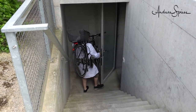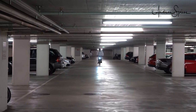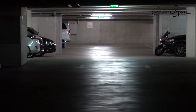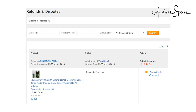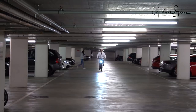The next issue is the ambient light. This can be solved by shifting the tests to our garage — no, it does not belong to me, neither all these cars. Here we can test without sunlight and distances of up to 100 meters. Our tests show that we can measure a maximum of about 50 meters if the target has a reasonably wide surface. At least better than outside. This is a clear indication for a dispute on AliExpress — this product is wholly oversold and I want at least part of my money back. In darkness, we see the laser pointer over a distance of more than 100 meters, even if the rangefinder only shows results up to 50 meters and only on certain surfaces.